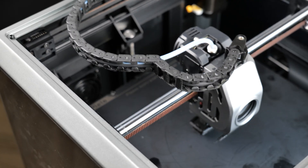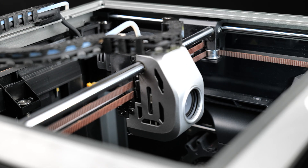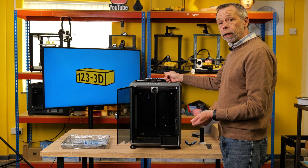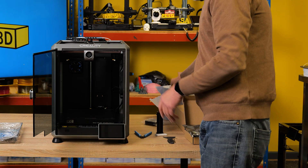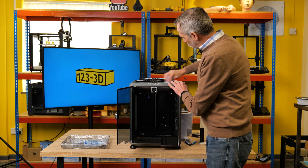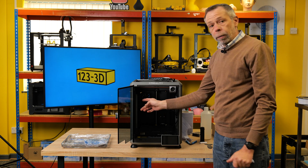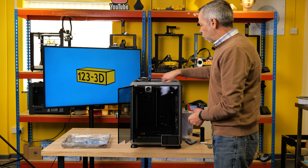Creality ships all of the printers with grease on the smooth rail on top of the extruder axis. The actual extruder carriage is fitted with self-lubricating bearings, and these don't like grease or oil. The idea is that you clean this oil and grease off, making the rail as smooth and clean as possible. This makes the bearings a lot more efficient and you'll end up with smoother motion. Easiest way to do this is a paper towel and a little bit of IPA alcohol — literally just remove the grease from the rail. This is to stop oxidisation on the rails during transit. The only parts you want to be lubricating and keeping lubricated are the lead screws down both sides and the back of the machine. Everything else wants to be as clean and dry as possible.